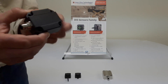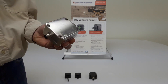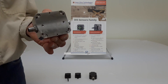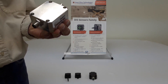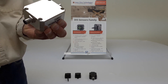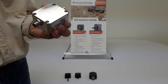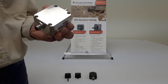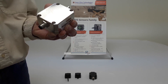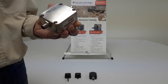The QG65N also has better RFI/EMI protection with a special plastic. The QG76 series is our most rugged device — fully completely stainless steel — available in QG76 and QG76N versions. Just like the QG65, the QG76 is fully programmable and the QG76N is CAN open for networkability. The QG65 and QG76 series offer 0.07 degree accuracy with 0.01 degree resolution, whereas the QG65N and QG76N series offer 0.15 degree accuracy and 0.05 degree resolution.